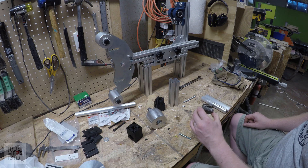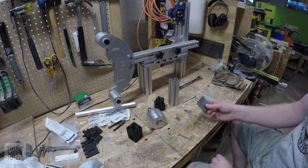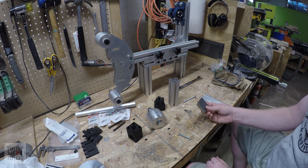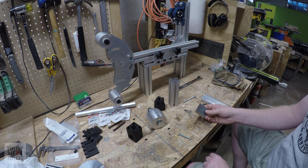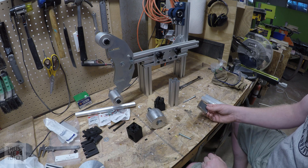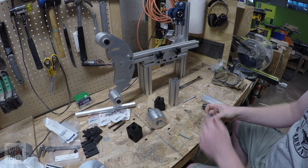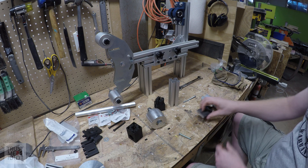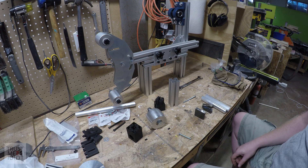For now I went to the hardware store and got a half-inch thick by two-inch wide piece of cold rolled steel, and we're just going to drill it and make our own hinge out of this. I still want this to be a no-weld solution, and the hinges you can get at the hardware store are just too thin — there's not enough meat there with a bolt and everything to grab onto. So we're going to try this instead. It's a little bit thicker but we've got a little bit of space to play with. Drilling the holes through that should be fun and smooth and painless — what could possibly go wrong.